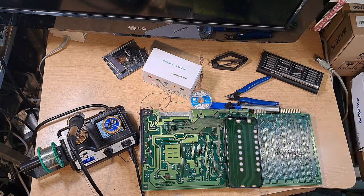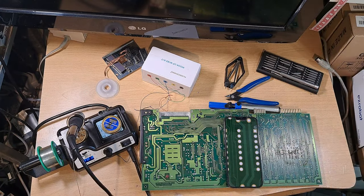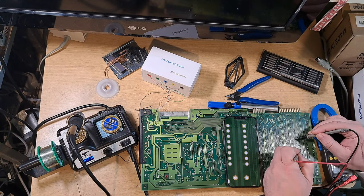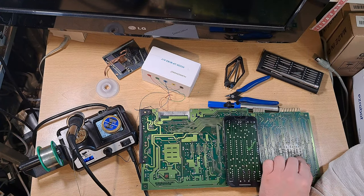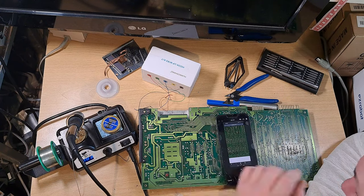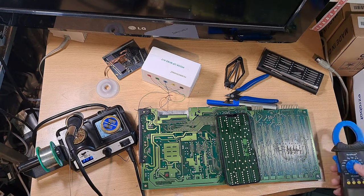At this point I think the battery in the multimeter was too low and it just wasn't working quite right, so I wasn't sure if I was getting correct continuity or not - so I swapped over testers. Just testing through everything and marking off the chips I've checked in green - putting a tick next to each one so I know it's good, then moving on to the next one. All looking good.